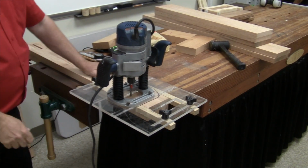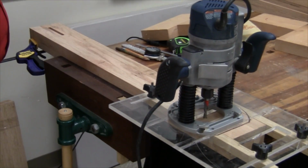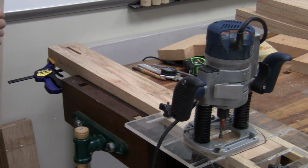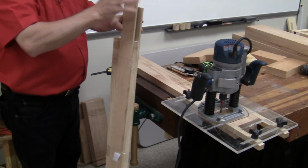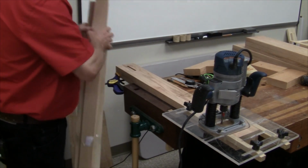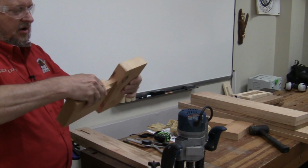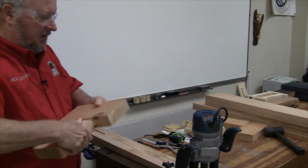All right. So once I do that, then I draw reference lines showing the length of the tenon. I'm going to use loose tenons, and I'll plane them to the 3/8 thickness or 3/8 widths that I have, and use a 3/8 roundover bit to round the edges over so it fits in that rounded corner. Now you can take your time and do it the old standard way and chip those corners out like that, and you can do it like that, but I don't want to mess with all that, especially with small ones. There's no gain from it.